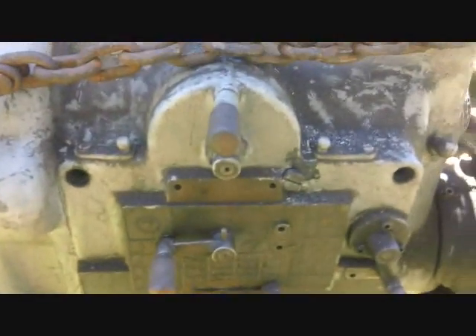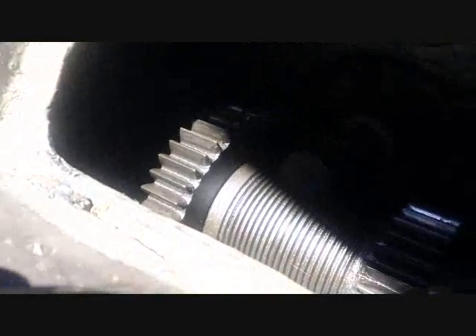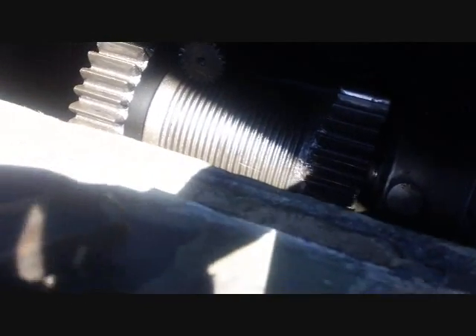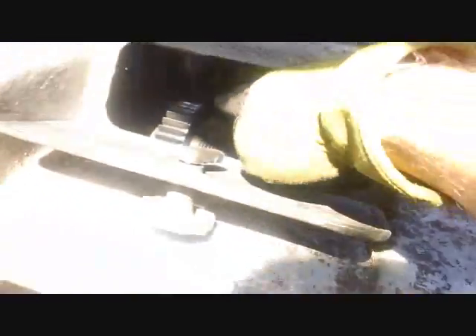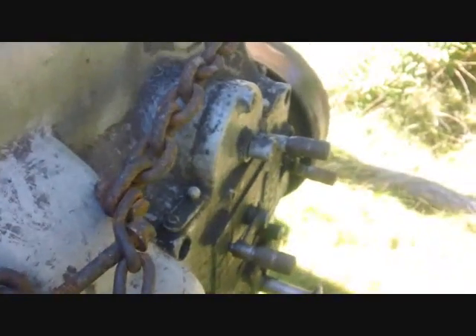I see this actually ends right here — that line right there. This top lever right here, what it does is it actually rotates that little gear in there and moves this sleeve back and forth, deciding which gears are going to be engaged. Because of the design of that gear, it allows us to still turn freely. That shaft right there is actually the back of this shaft right here, so if I gently tap on that I should be able to pop this out.